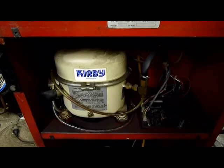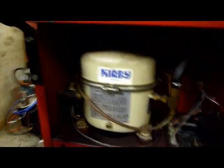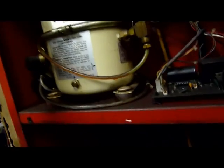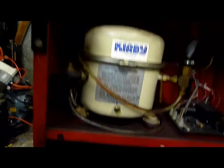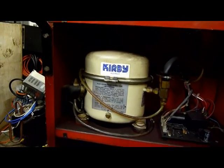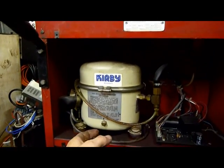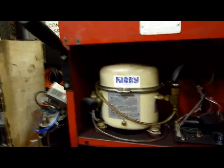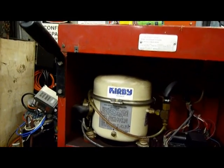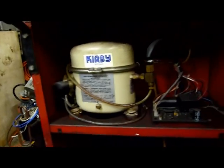I better turn it around and get into the back of it. There's the vacuum pump — kind of looks like a fridge compressor, and that would be correct because it's based on a fridge compressor, made by Kirby Refrigeration. It's a neat little unit. You can buy air compressors based on the same type of configuration. The top and bottom shells were never welded, so you can use them as a silent air compressor — definitely a keeper as long as it isn't burnt out or damaged.